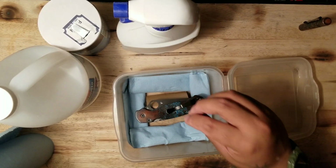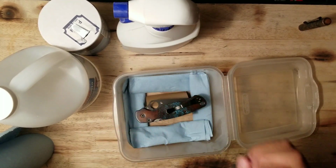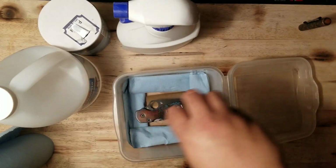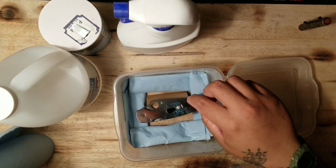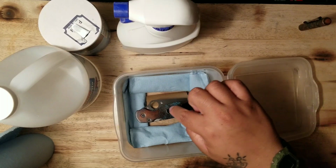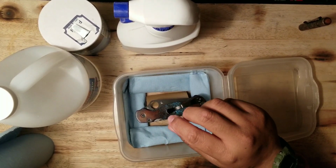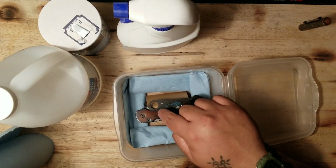So what you want to do is, if you really want this coloring the whole length of whatever you're gonna patina, spray it down with the ammonia completely, just drench it. After you drench it, get the sea salt and just sprinkle over it. Do that Salt Bae thing, sprinkle over it. That's going to give you more surface area open, but also covered at the same time. It's going to allow more of the fumes to oxidize the copper, and that's where you're going to get that coloring from. So whatever you want to be blue, sprinkle lightly, don't cake on. When you cake it on, it still patinas the copper, but it turns it that dark color.